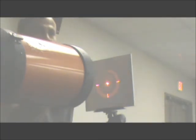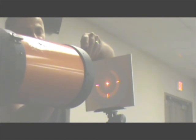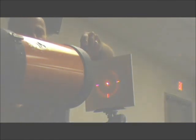At this point, your focal plane axis is aligned to the primary mirror's optical axis. Now reinstall the secondary mirror assembly into the telescope. So for most of the guys in the club, since they don't have adjustable primaries, we just have to do the corrector plate and the secondary mirror. Double-check if the scope is still aligned with the collimator and adjust if necessary.